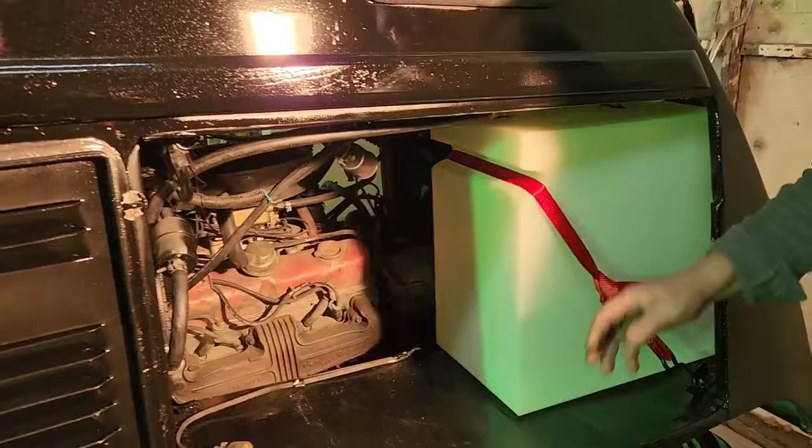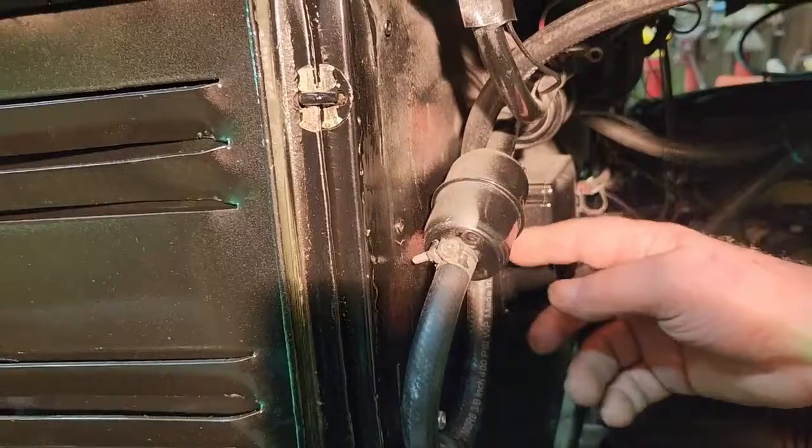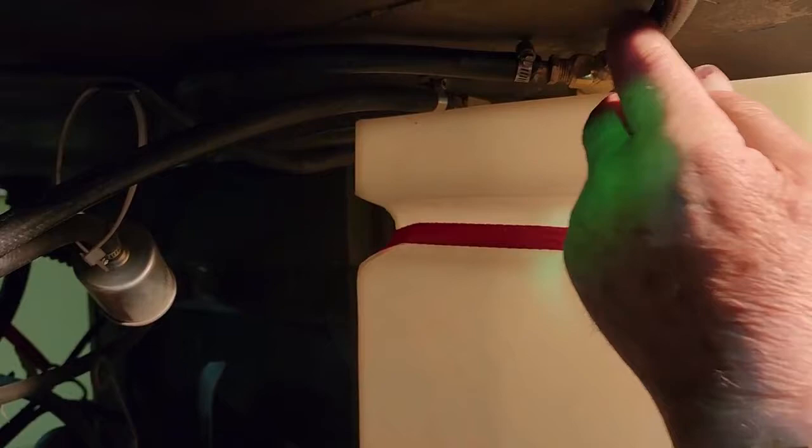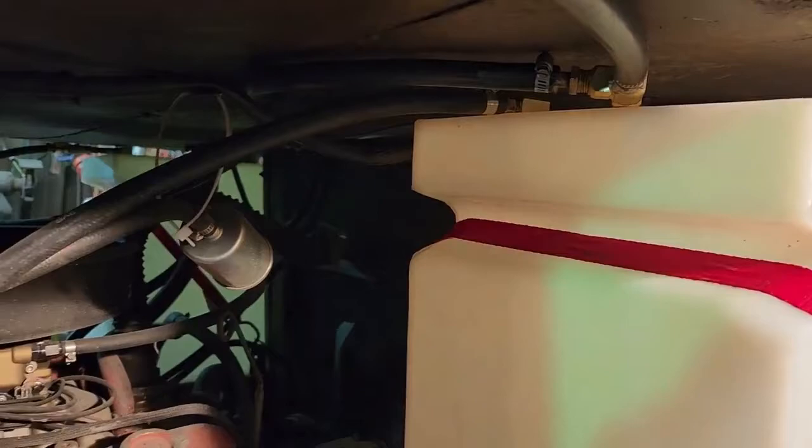Are they expensive? This filter here is an ordinary filter — that's just a suction line, so it's not under pressure. If you look in here, this hose draws from a tank, that hose draws from a tank, and this hose is a return into the tank, because the fuel goes in one end and what it doesn't use goes back into the tank.